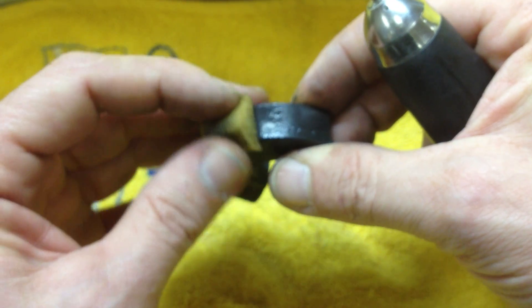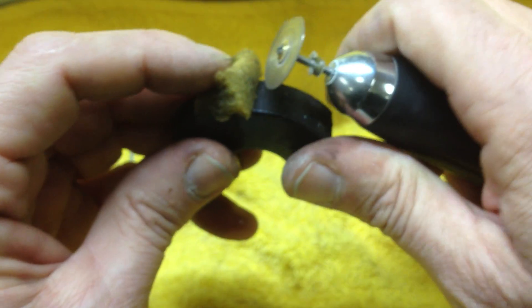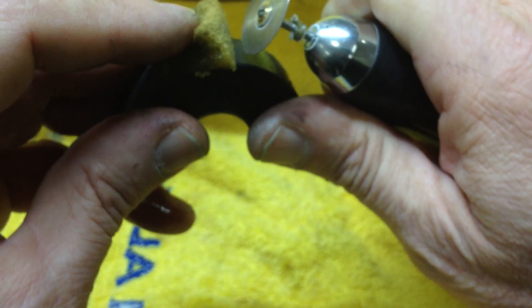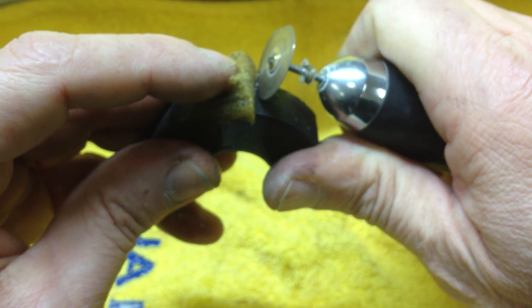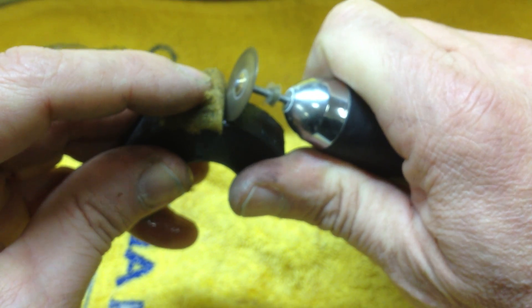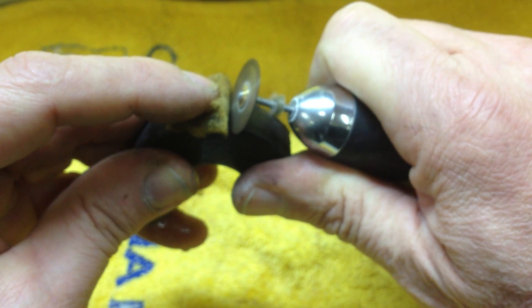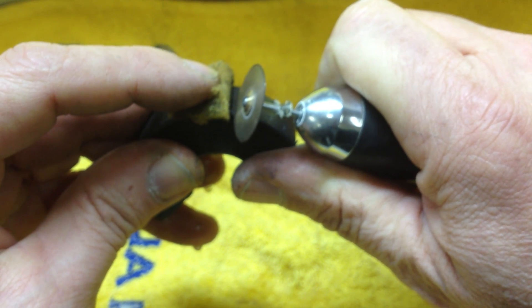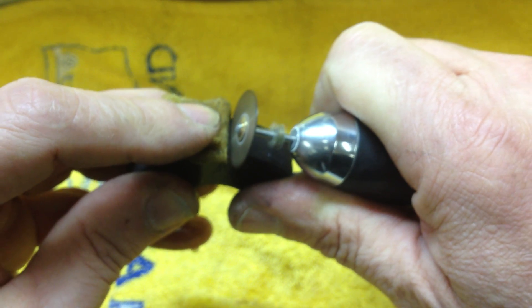There's the water. I've always got to make sure that it's not dripping wet, but it's wet. How I do that is actually contact the sponge on the face of the disc as it's cutting. Also, I control my speed and I don't go too fast because speed builds up heat, and in a ceramic magnet, that's not what you want.